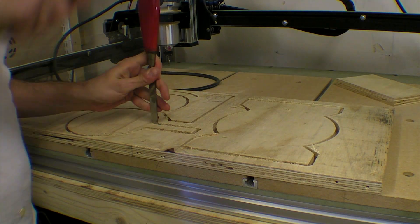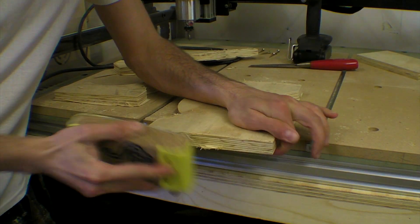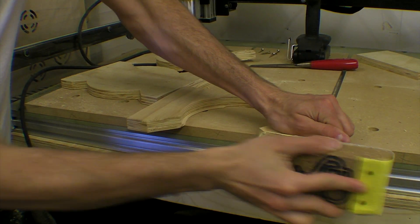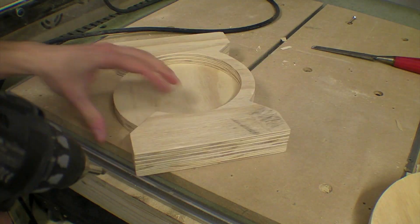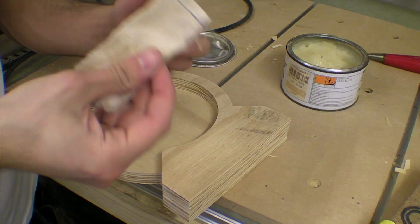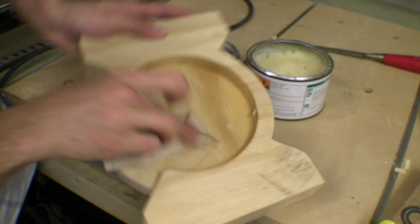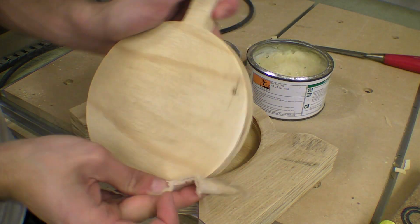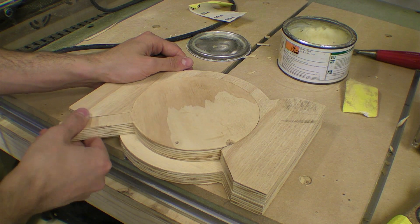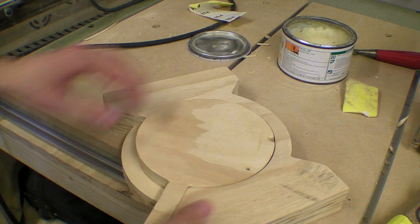I freed the parts from their tabs and began sanding the pieces to clean them up. I didn't leave any gaps in the SketchUp model between the turning component and the top collar, so when the two met and the top was screwed to the base it was very hard to turn. I tried to put wax between the moving parts but I think I'll need to make the turning component smaller by half a millimetre in the software for the next version. The turning seen here was actually achieved by sanding the contacting pieces a little and pushing the collar loose when screwing it to the base.